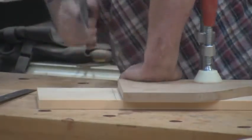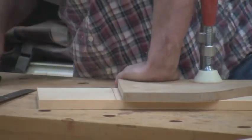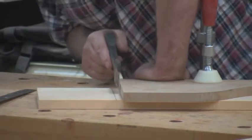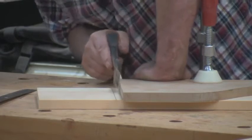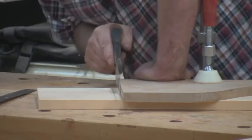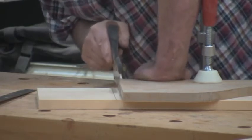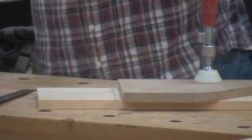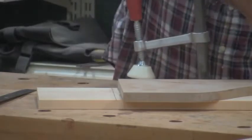Just a saw. Now, you've got to cut on an angle. Don't get out past your stop point. And this dado only needs to be about 1/8 inch deep. Now, why the scrap wood? If you can cut it straight, go ahead. If you can't, look, a little bit of wood just helps you cut it straight.